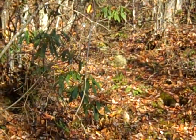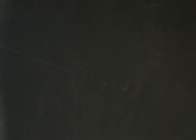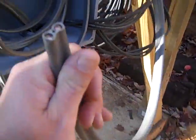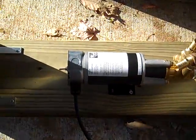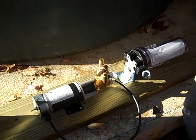The spring box is collecting the spring water at its head and then coming down to a tank here, which has an overflow that will fill the big tank — a 2,500 gallon cistern. Our solar to run this pump is around 500 feet away, using real heavy number six wire so we can minimize voltage drop coming down a long ways. I'm going to be using a Dankoff 1304 — a 48 volt motor and pump setup. We're going to be pumping the spring water up to two tanks on top of the mountain.